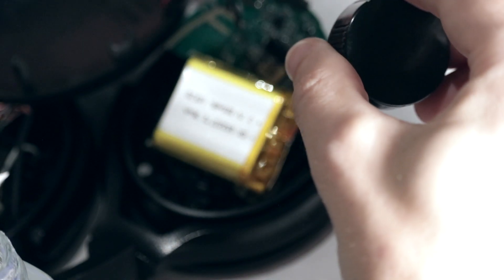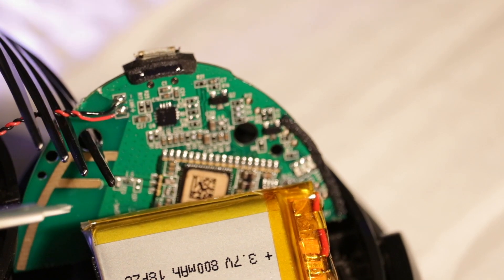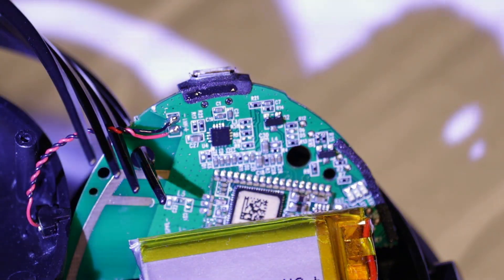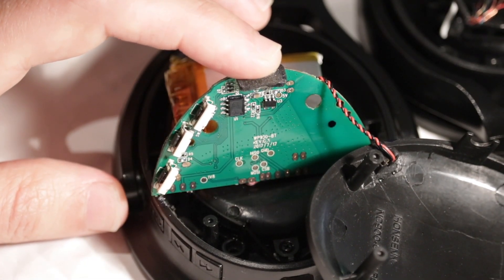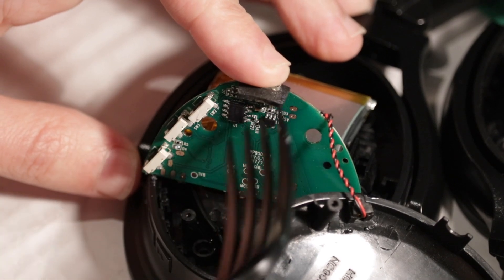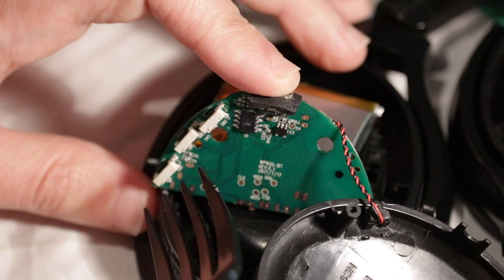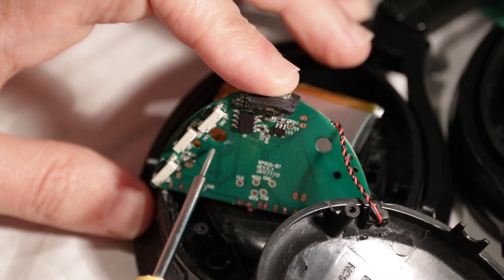Those modules are made separately so that they can be separately tested and certified. I've actually covered both sides of both boards. The boards have been left to dry overnight, which is probably overkill. The coating itself is transparent so you're probably not going to be able to see it, but in person it's visible as just a shiny thin coating. Within the right headphone I had some problems getting the buttons to work — I must have gotten some silicone into the actual micro switches, and that's a problem. I played with them a little and seem to have gotten them to kind of work, but if anybody else is trying this I would definitely try to avoid doing that. It's also really hard to debug even with a multimeter because you've now coated over the pads and have to scrape away a little bit of the silicone to get a probe on them.